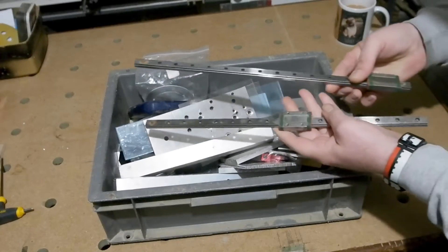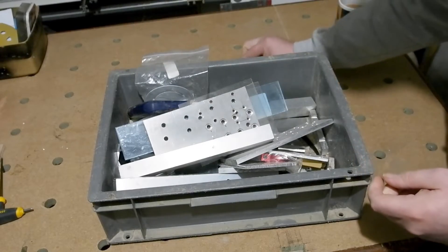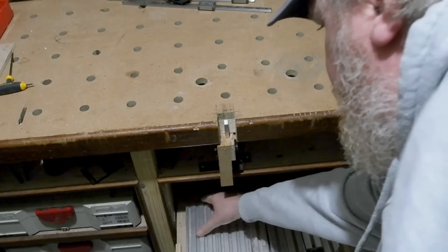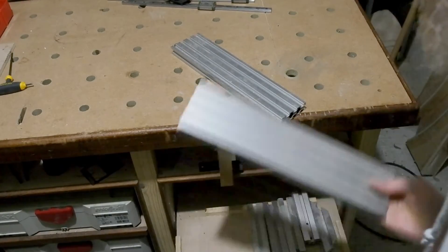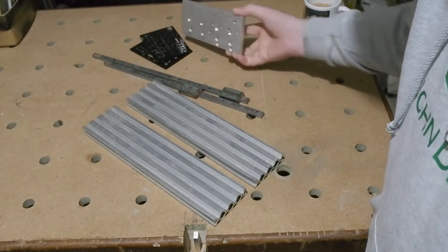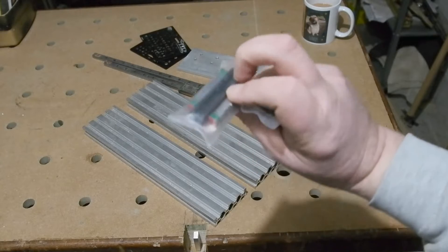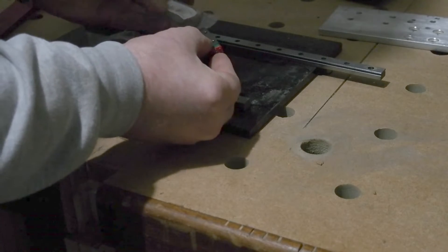I've had making this on my mind for some time, as I've had these 300mm linear rails just hanging around. I didn't have a design or a plan - the plan was simply to make a drill go straight up and down using parts I had to hand. Having gone through three iterations of my over-router machine I've quite a lot of bits to select from, not least pieces of 2080 extrusion. I'll be doubling up the linear rail bearings - anytime I ordered a linear rail I'd buy a bearing block and a spare, and these have sat in the parts box.